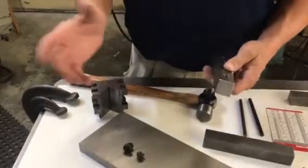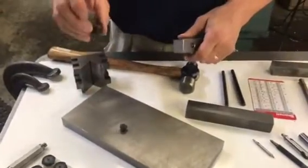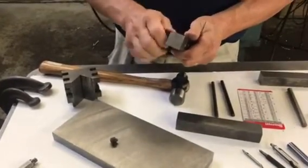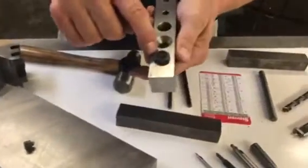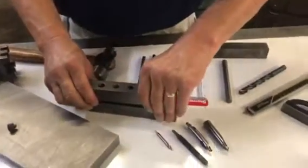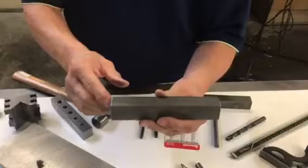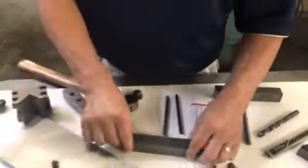Sometimes when you've got a block and it's got a threaded hole in it, the threaded hole doesn't go all the way through. So what do you do to transfer that hole in the right location? They have what's called spotting screws. You screw this spotting screw in there — it's threaded into that half-inch 13 thread — and it's got a ring and then a point on it. You give it a pop, and it marks the center of the screw hole.